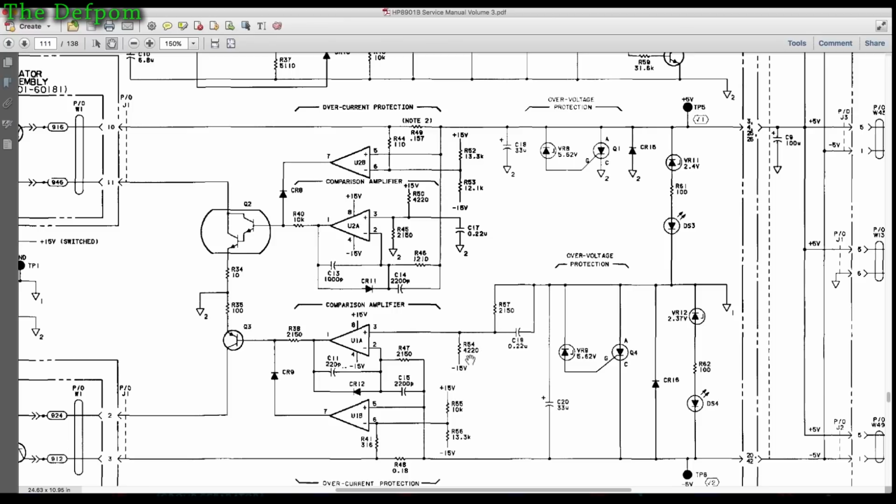So I could compensate for it by just adjusting these resistors very slightly. It looks like they've been very specially chosen anyway, but you could easily stick a little VR on there, something like that, and change the voltage to what you actually want just by tweaking those resistors. It's doable, but yeah, it's just slightly off value. It's probably just these resistors have aged very slightly and gone a fraction off value. I bet if I measured them, you'd see that the values aren't quite right, quite possibly.